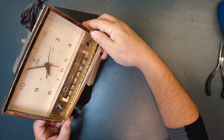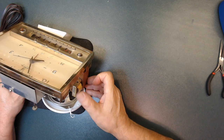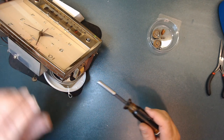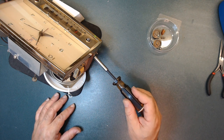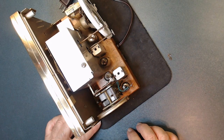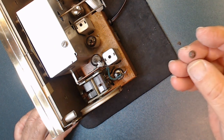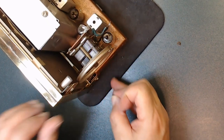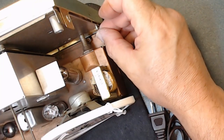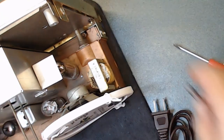Let's see if this way is going to be easier to install or not. Now I'm going to put the screws here — I see there are two here and one up there. These are very small screws. As soon as they stop, let go — do not force it. You could break the screws, they're so small. I may need different tools for the other two. This is installed finally. Now I'm going to put these two small clips back here — one right here, and another on the other side. If you have a tool like this you just put it over it and press it inside. Both sides are installed.